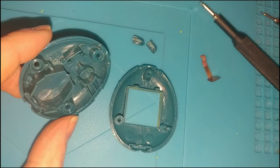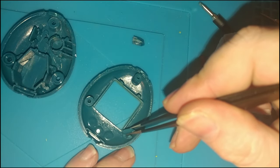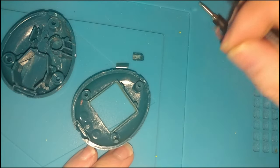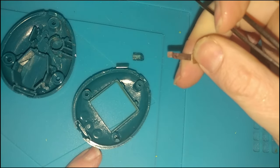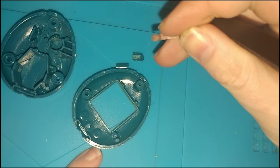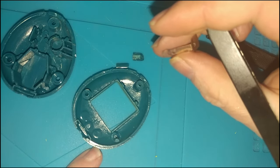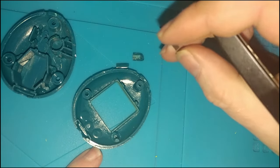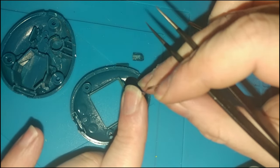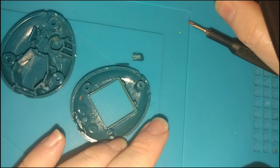Alright, focusing our attention back to this one, because it's dried up, I'm going to try to super glue these back in place. Don't know if it's going to last very well. Additionally, the vinegar, I cleaned this off with alcohol afterwards, took off the nickel plated coating on this copper little contact sleeve. So more than likely I'm going to clean this up and use some lead free solder to give it some type of plating. So hopefully it doesn't corrode again in the future.